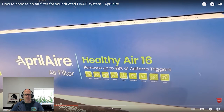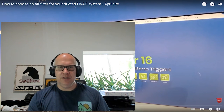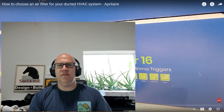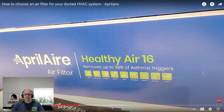The MERV 11 stops at dust, while the MERV 16 also captures dust mite exoskeletons — which are what actually trigger allergies — plus odors, pollution, and viruses. These things need to be filtered out of the air, especially given current pathogens and pandemic concerns. We strongly recommend filtration over adding chemicals to the air to try to kill these things.